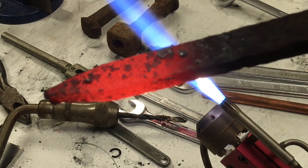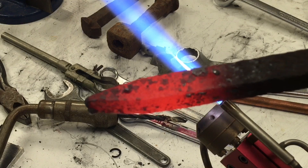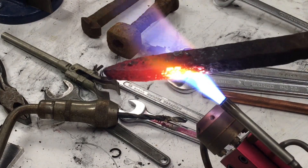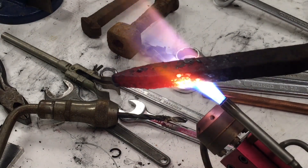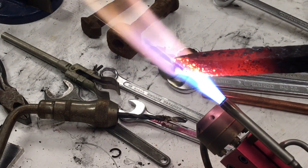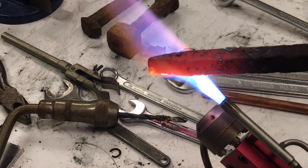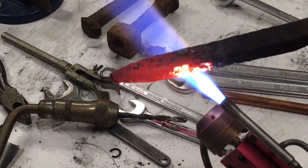You can see here now that we are up in temperature, which is far above what you can ever get with a heat gun or a normal torch, but it's glowing now in red. At this point we can safely say that we've expanded the pure metal — the iron underneath the rust — to such an extent that we can't get much further up. So if this is a case where you can actually shatter off rust by expanding the metal underneath, we won't have much rust left here on the top.